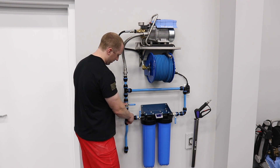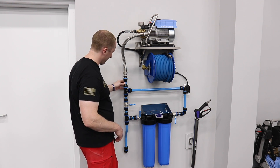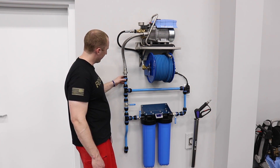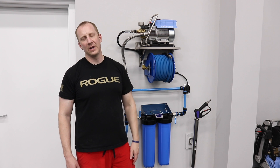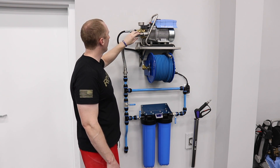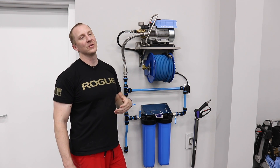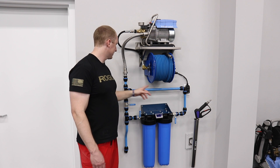The valves are one-inch in size but have a three-quarter-inch reducer to fit right into the CR Spotless. I cut four-and-a-half-inch pieces of pipe between fittings. We have a couple of T's and a reducer that goes into a full stainless line — I could only find this in T316. We have a T316 line that is 24 inches long going into a 90-degree T304, which connects to a reducer and a garden hose reducer converting our 3/4-inch NPT to 3/4-inch garden hose, then a quick disconnect — and that's the finished termination.